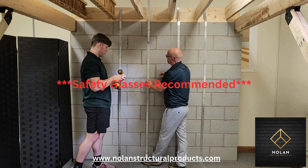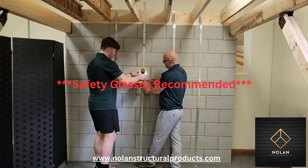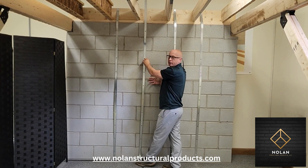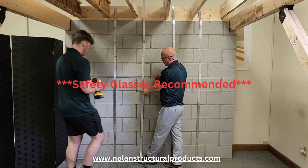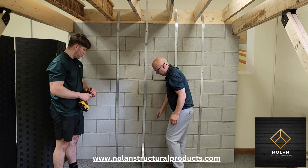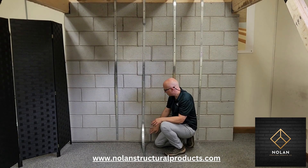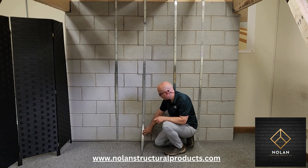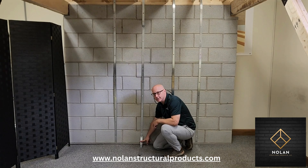Wear your safety glasses. Because this is foam, we are not pre-drilling, but you would actually pre-drill with a 3/8 inch masonry bit, which we'll show you in a moment. These get one screw per block, but when the wall gets to a certain height, because of the tension developed in the strap, it will start requiring two screws. So this wall would need two screws in the bottom block. Once the strap is installed, you just cut off the excess at the bottom.